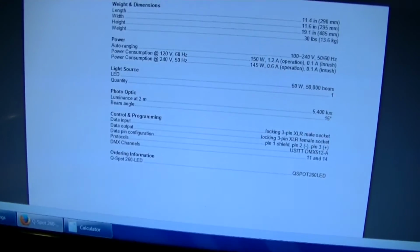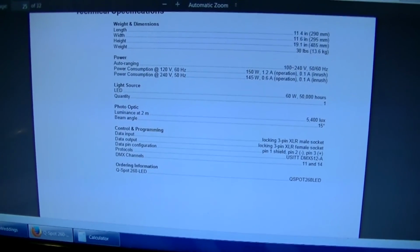That's not including if you guys are trying to plug in anything else, like more lighting, some uplights around your booth, some lasers, some fog or haze machines or anything like that, because then you're pretty much going to max it all out. So you ought to definitely be plugged into a 20 amp circuit if you want to pull all that. Let's just give you a little something to think about as far as power distros. If the building offers it, yeah, I'm going to plug into it, but not all venues have it. But if they do, I'm going to plug into it.